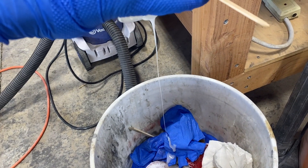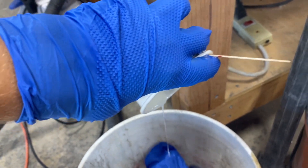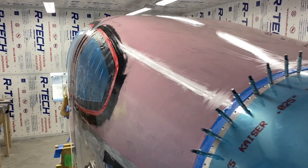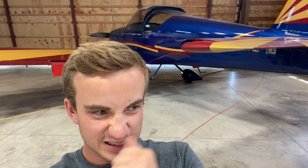Just finished the last little bit of epoxy. Used significantly less this time than yesterday to make it look smooth — always a good sign. If you look, it's all shiny now and you can't really see the pinholes you could see before — just the honeycomb structure. That's really really good, went on really well. Now letting it cure and then going back to work on the cowling.